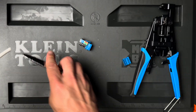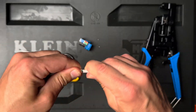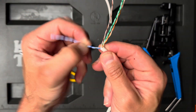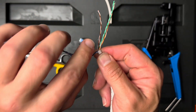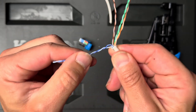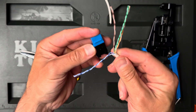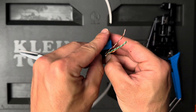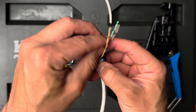Somebody requested that I show them how to land the wires into the vertical cable keystone. What I typically do is start with blue and then just do a little turn and get it open just enough so you can use these notches in the keystone jack. This is specific to the VMAX keystones — they have these notches in it.